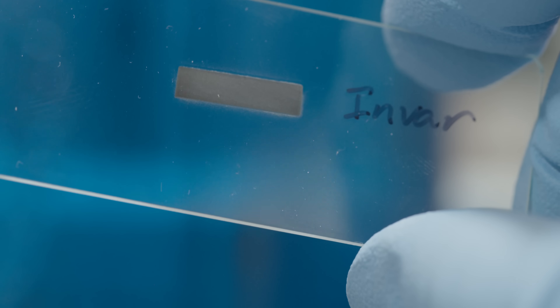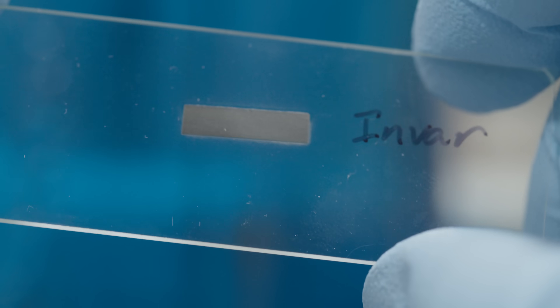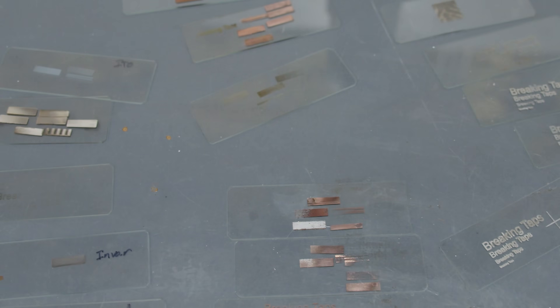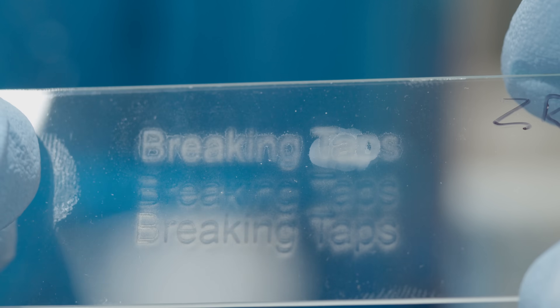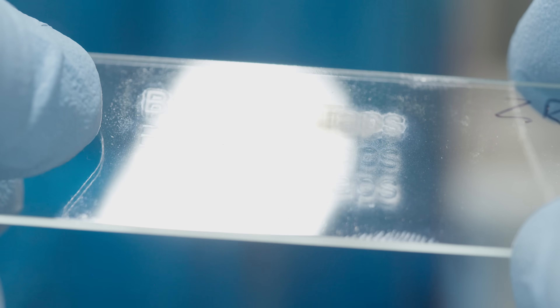What it actually ended up doing more reliably was transferring the metal onto the glass. I've seen this effect before when playing around with the laser, but this particular set of laser parameters and metals was really reliable and consistent. I've successfully transferred aluminum, copper, titanium, silver, niobium, indium tin oxide, and Invar 36 to glass. It seems to work for just about any metal that a fiber laser can ablate — anything susceptible to the 1064 nanometer wavelength.